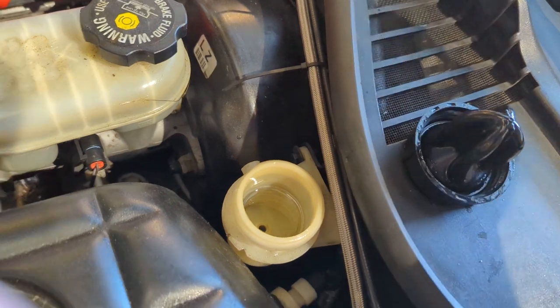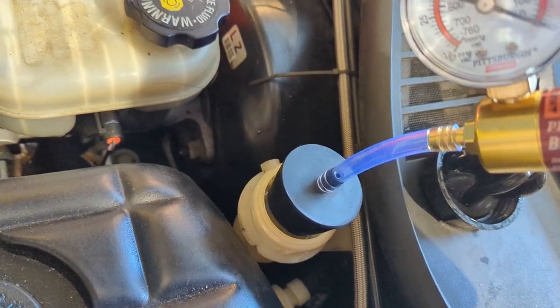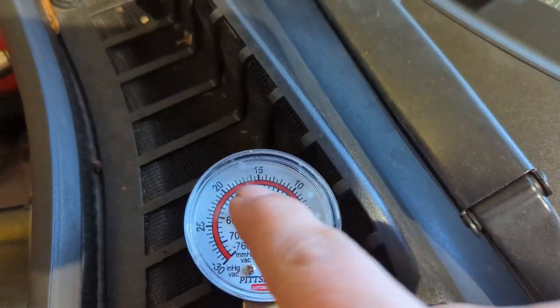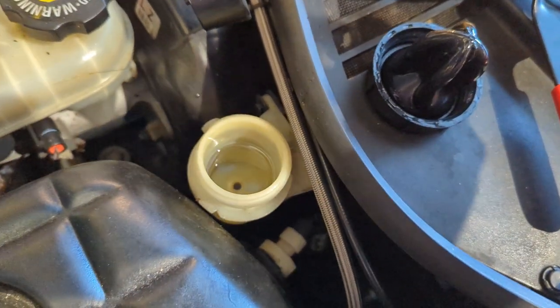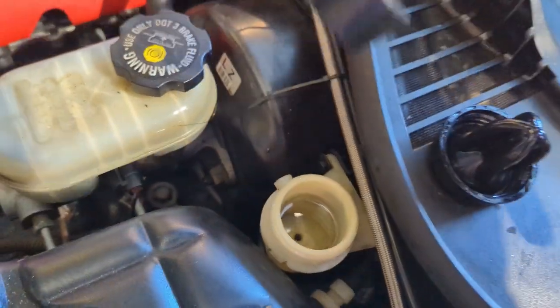So imagine this is almost to the bottom but not quite. The size of this diameter is amazing — make sure it's nice and dry. You're gonna drop it in there, hold it kind of tight, and it'll seal pretty quickly. Just pump it up to about 15 pounds or 15 inches of vacuum, and any air in there you're gonna get it out. You might hear it. I heard the initial one like I said, and then once I took it off I saw bubbles coming out for a little bit. I did it, cycled it three times, and what a huge difference — I was shocked.